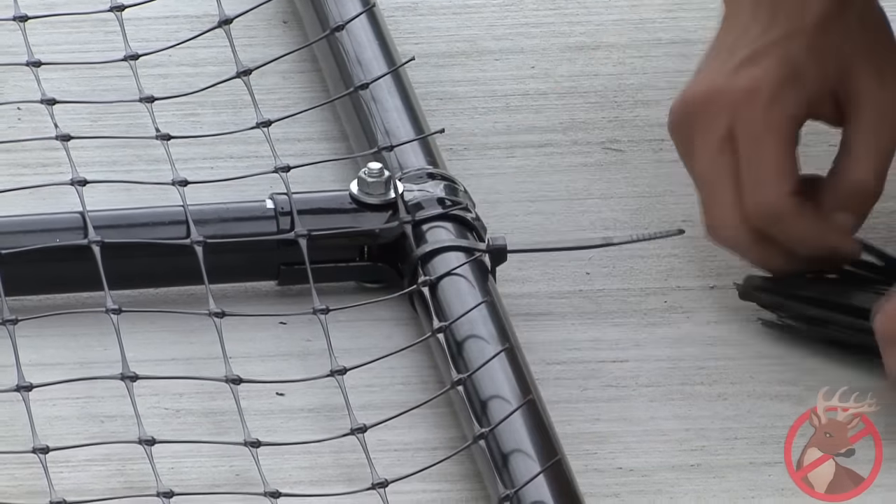Secure the fence to your post by using five to six self-locking ties per post. Use 14 inch ties for deluxe heavy duty posts, driveway gate ends, or corner posts. Use the eight inch self-locking ties to secure angle steel posts to the fence. Use a tie puller and cutter tool to tighten the ties and trim the excess plastic. In order to keep your fence as taut as possible, you should keep it rolled up and let it feed out as you go along. We recommend at least two people for installing your fence for a quicker and safer installation. Once all the fencing is in place and tightened to the posts, cut out around the door of your gate, then remove the excess fence.